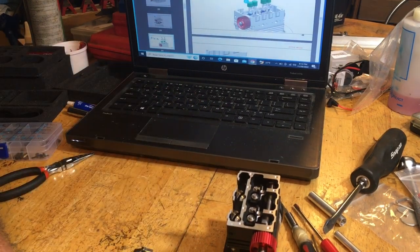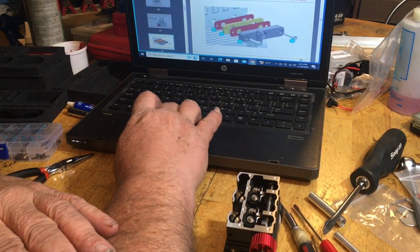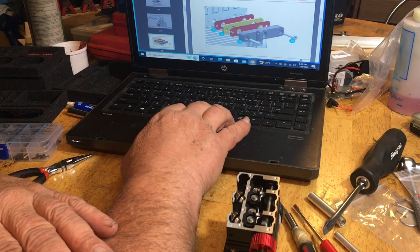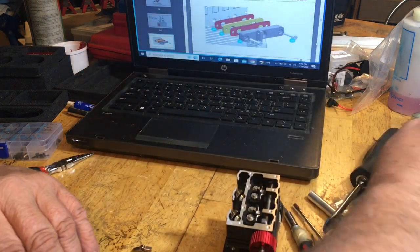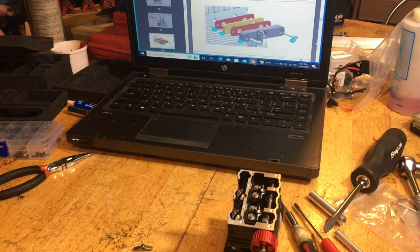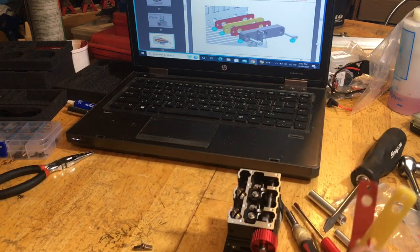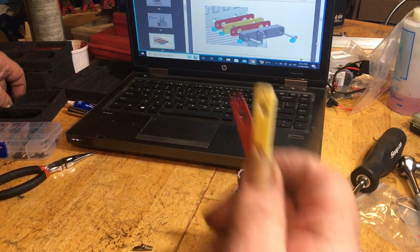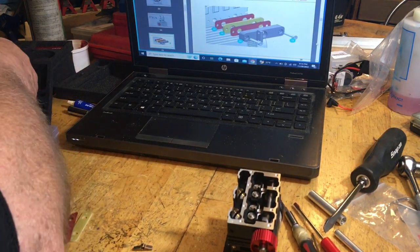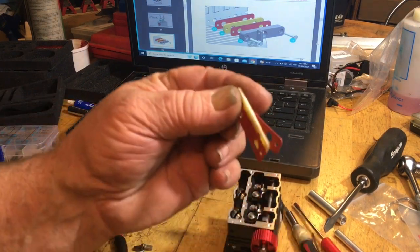So in my gasket kit, before we get to the rocker arms, I don't have these 249s. These are not within my gasket kit. I only have a valve cover gasket. Oh, they slid them in here. Thank God. Look at that, huh? See, this is how you learn, guys. They stuck them within the spacer. So I do have the gaskets now.